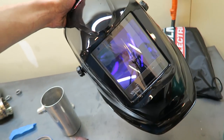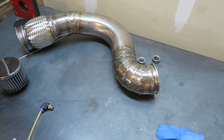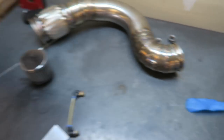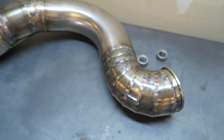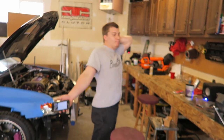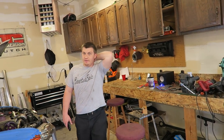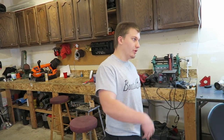Also got a new welding helmet — looks pretty nice, same one Hayden has. Works pretty good so far. He also got the down pipe done for the Evo. Looks real nice, just got that done. Yeah, that took forever — all those pie cuts. There's a really tight radius in there. I left and you were still working on it when I came back. It was a good couple hours. I just need to get my purge plugs made so I don't have to use the tinfoil. The tinfoil pops out all the time. Yeah, to back purge it with gas — you gotta wait for it and let the purge go back through it.